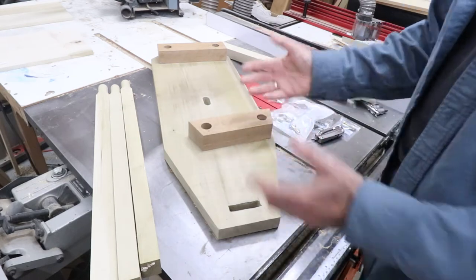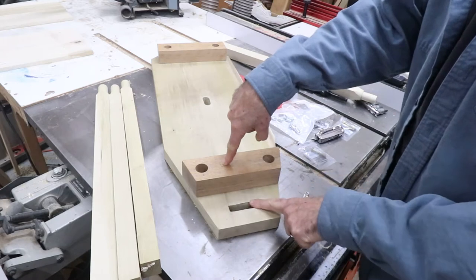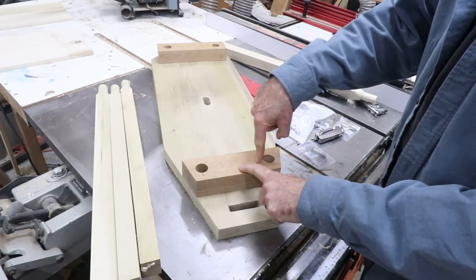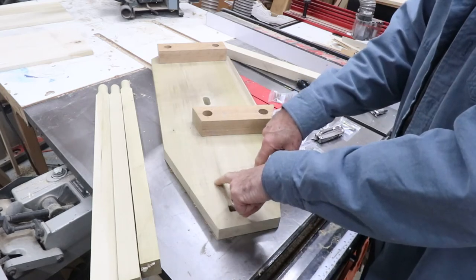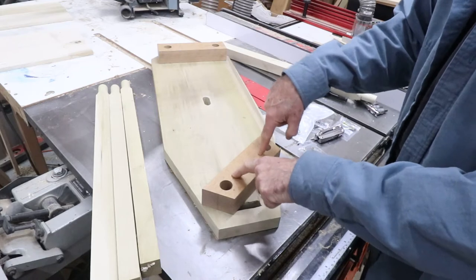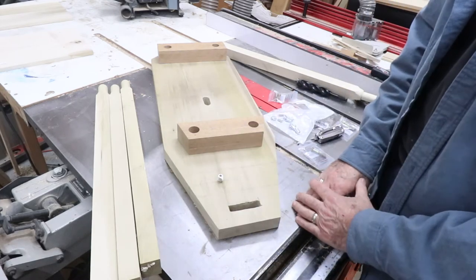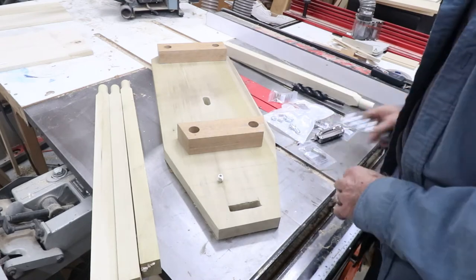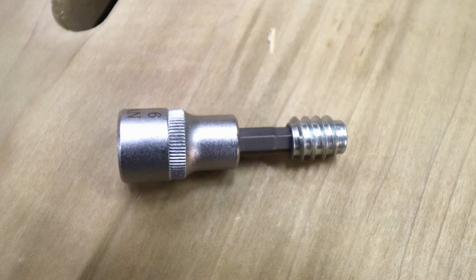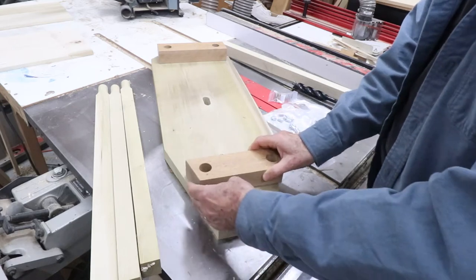So how am I going to get everything lined up? I take the block that holds the legs, fasten it down to the table with double-sided tape, then drill holes through the block into the table at predetermined locations. When I remove it I know exactly where to drill the holes for the inserts and where to counterbore the holes for the bolts. Once I drill the half-inch holes and put in those inserts, they're not going anywhere, and for added protection I'll also add epoxy. They're driven in with a six-millimeter hex and an impact driver — it just makes life a whole lot easier.